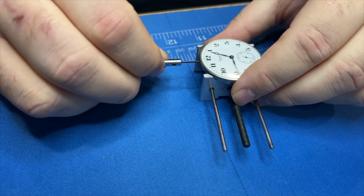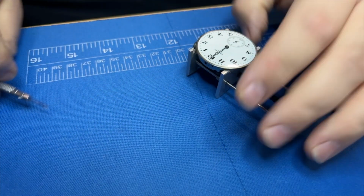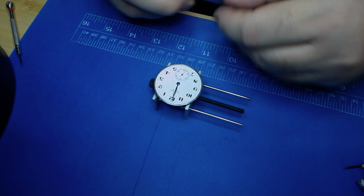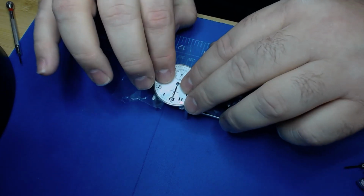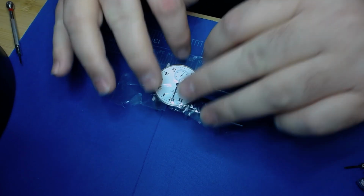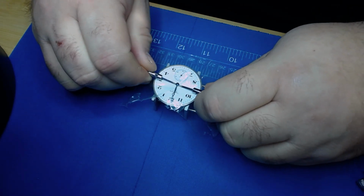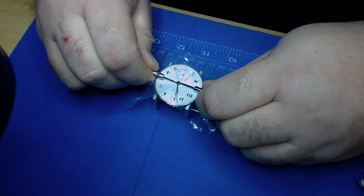So now I'm just setting the hands to 12 o'clock. They're a little bit easier to remove if they're both pointing in the same direction. You can get your levers in a bit easier. I'm going to put some plastic on there just so that when I stick in my high quality hand removal levers, they won't damage the screen. And as you'll see in a second, my high quality levers are 2 screwdrivers. So it's even more important to put some plastic in there. Maybe at some point I should actually buy some proper hand levers.